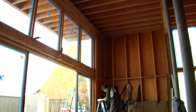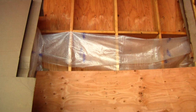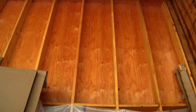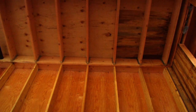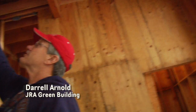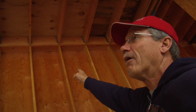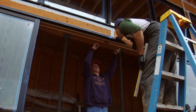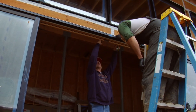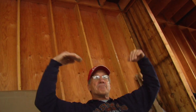The layout in here is all on two-foot on-center, and you have single top plate construction, which is not typical — conventional construction uses a double top plate on top of the studs. When you use a single top plate, you have to make sure that all your members stack. If you look up at the ceiling, the roof rafters coming across will line up exactly with the studs on the wall, so everything stacks and loads properly. You can't place a load between studs with a single top plate because it's going to bend or sag the top plate down.